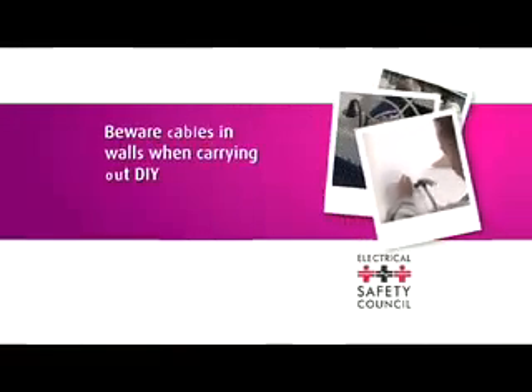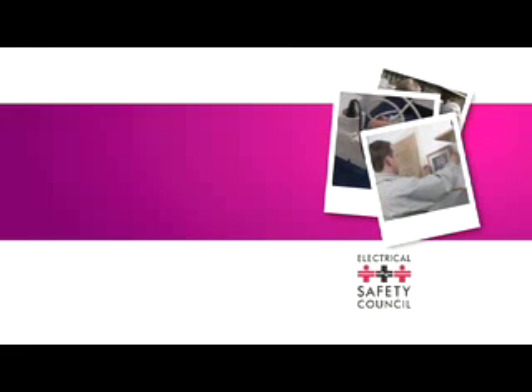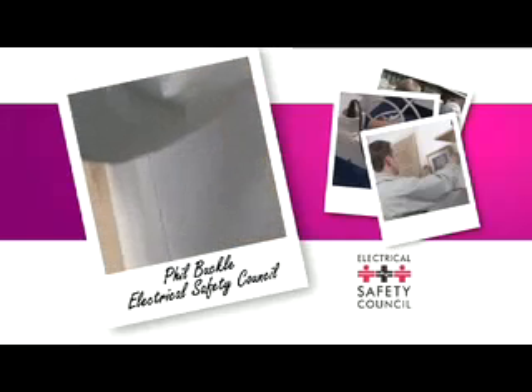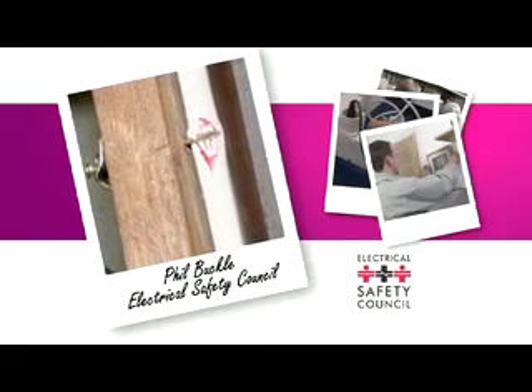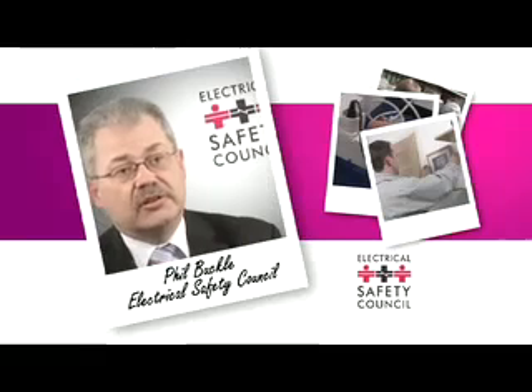Walls and partitions conceal electrical cables as well as gas and water pipes. A cable detector will help identify the presence of concealed cables, but if in doubt, consult a qualified electrician. Anybody fitting something to the wall should always check for service pipes or cables before commencing work. Particularly with electrical systems, the cables generally run directly down the wall to the outlet. So first of all, check that there is no socket below you. If you're unsure, you can buy detectors from DIY stores which detect cables in walls. People have died as a consequence of the problem of penetrating cables.